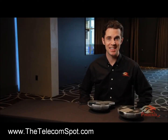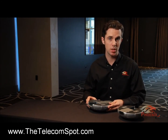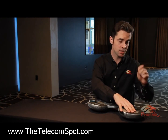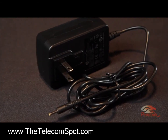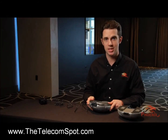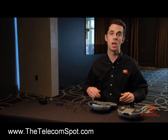All the models outside of the MT301 support this function. In a similar way to what we demonstrated before, designate the first Quattro in the chain and use the daisy chain cable provided with each unit to connect between units. Since we're using a central power scheme, we don't need to have all the units connected to their own DC power supply. Connect the 48-volt power supply to unit number one — this power source will power all the units in the chain. If your chain has more than 8 units, you will have to connect an additional power source to unit number 9.